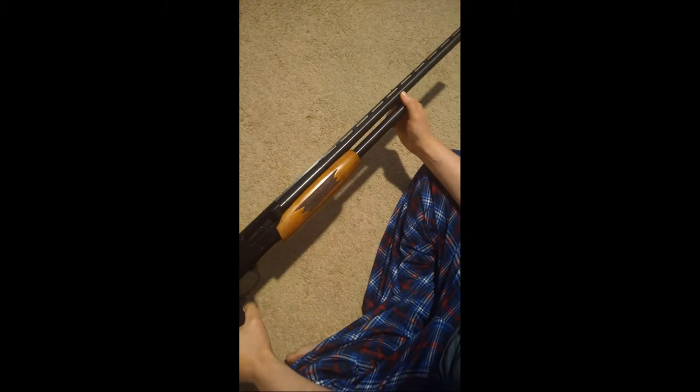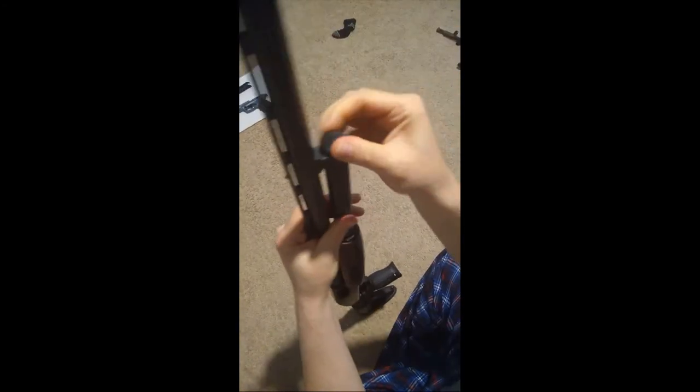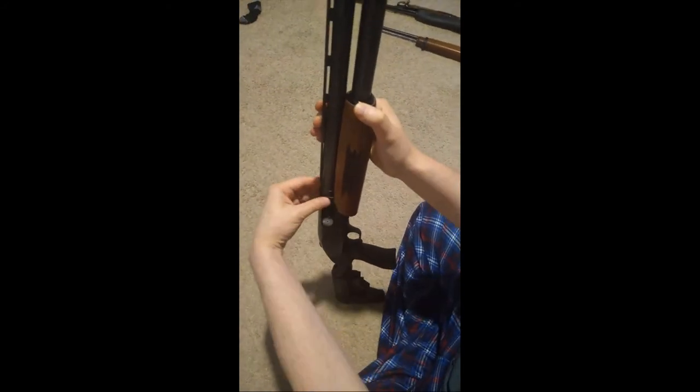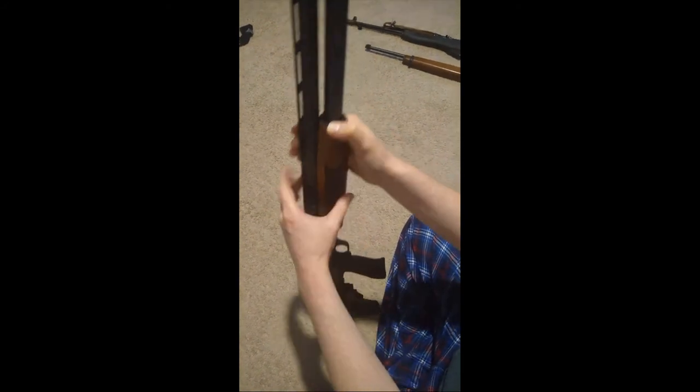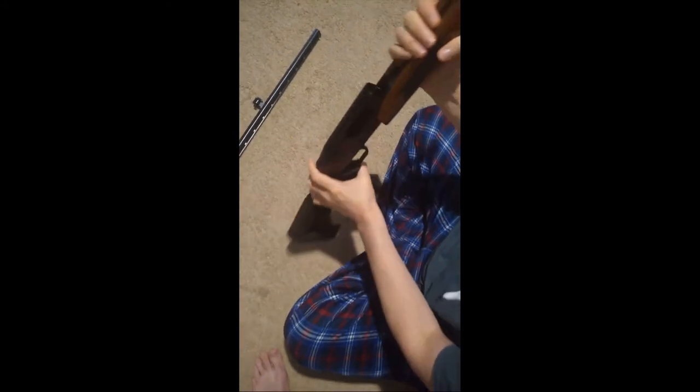I like to take the barrel off this shotgun — you don't always have to, but if I can separate the barrel from the receiver I like to do that, as it makes cleaning easier. Disassembly occurs here at this little knurled nub that just screws off. Notice I still have the shotgun action open — when it closes it locks in on where the barrel attaches to the receiver. So with the action to the rear, unscrew, pull up, and off comes the barrel. I now have the ability to swab and clean the barrel and get good access to the receiver, bolt face, and loading mechanism.